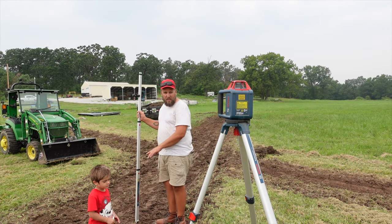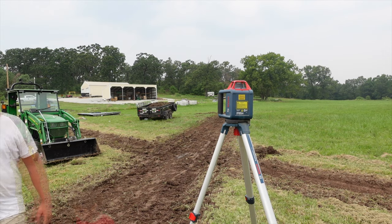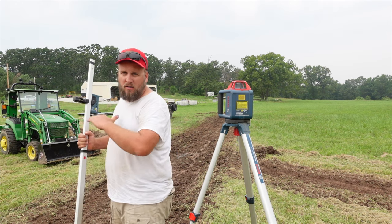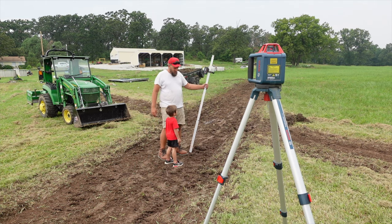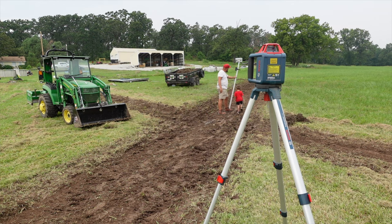We're set for this spot right here as our reference. Coming down here, I know we're considerably lower. Within three feet of the pond water, we have a pretty steep slope — it's dropping really quickly. We wouldn't want that the whole way, but we definitely want it right here at the pond. Starting at the low spot and working up, it's harder to tell how far you're off. So I went up to the top, reset the stick, and then started coming back to see how far the stick is off the ground. We just picked up the ground right here.